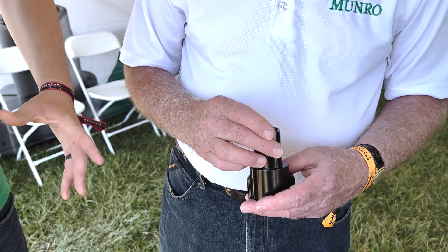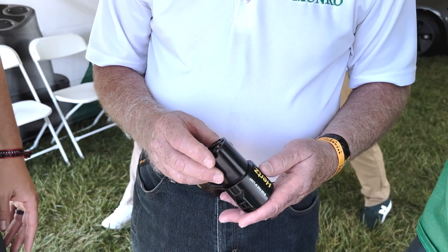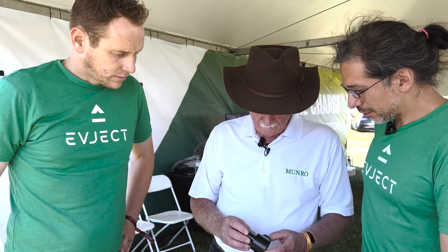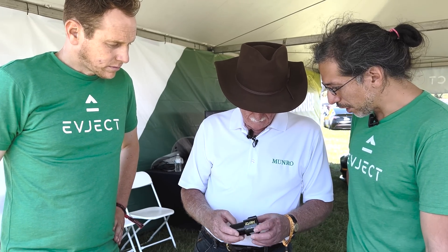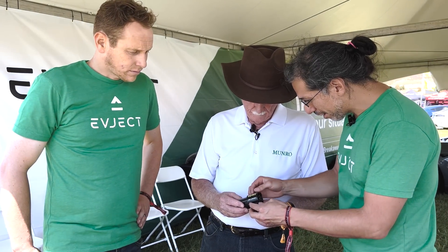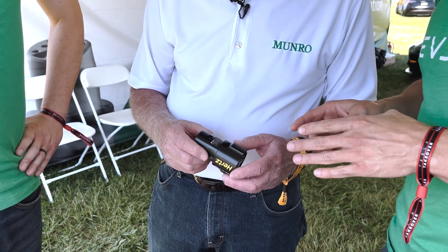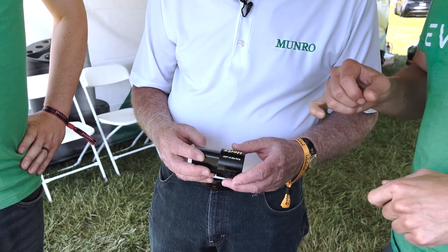In fact, these are the quality parts we're providing to Hertz — branded with the customers' name — and they also want EVJECT stickers that are Hertz-branded included with every rental vehicle. The full injection molded quality plastic is really quite good. Looking at the parting lines and the insertion molds of the cavities, this is actually a much cleaner result than most generic adapters. If you pay attention to other J1772s you'll see where the cores were made — it's essentially a five-piece mold — but we've gotten it quite a bit more simplified.